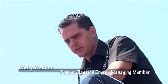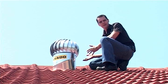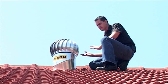It's important that we spend time to look at ventilating your roof space. Insulation and ventilation is like bread and butter — the one complements the other. With us installing the roof insulation and with the foil reflecting 93% of its radiant heat, you will find that all that heat is trapped inside the roof space. So ventilating your roof space is critical.